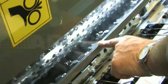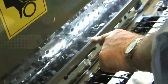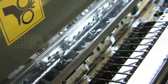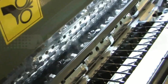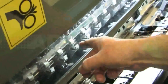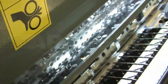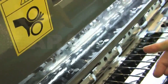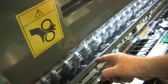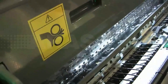Down here you can see the swing arm. On the back of the swing arm grippers there are some small rollers. These are to protect scratching from the back of the paper or of the carton board or of the plastic that we're running. That swing arm passes the sheet into these grippers on the, we call this A cylinder. This is the advanced cylinder, the infeed cylinder. The swing arm itself has got the capacity to actually cure a fan out problem.